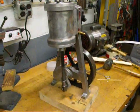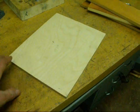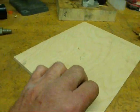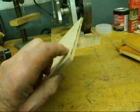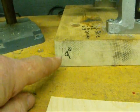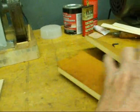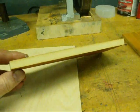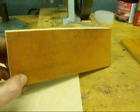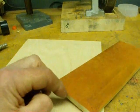We're done here for a while and I'm going to start turning my attention to the base. I've now started the pattern for the base. This is Baltic birch — 8 inches by 10 inches and quarter-inch thick. I've already beveled it on the table saw at about 8 degrees all the way around, and I want about an 8-degree slant. It's not really critical, it's just for appearance. And then we're going to use this half-inch stock. I'm forced to use wood that I found in an old drawer — I wanted some hardwood, half-inch thick, and didn't want to use plywood. So I've got some nice 70-year-old wood here and I've already jointed it at 8 degrees. Now I've got to reduce it to about an inch and a quarter because this is going to be about an inch and a half high.